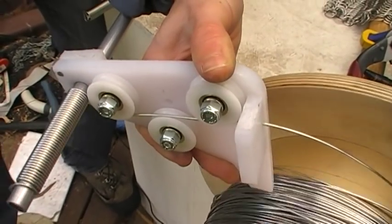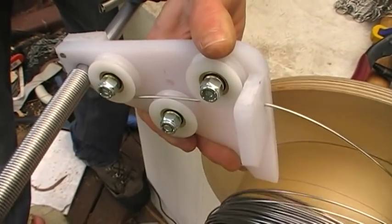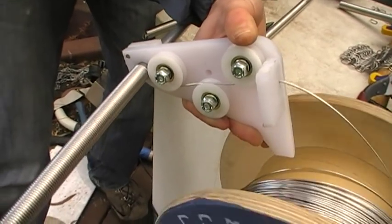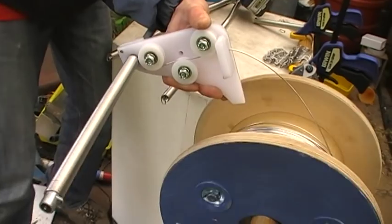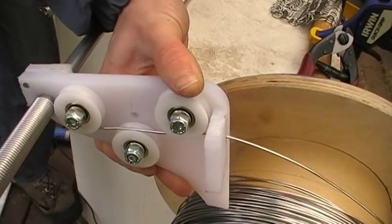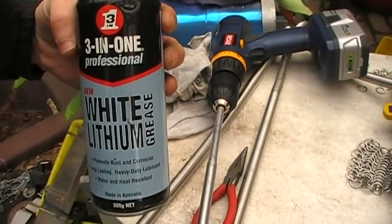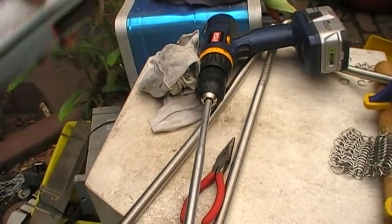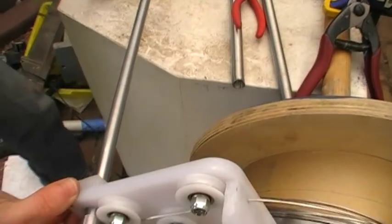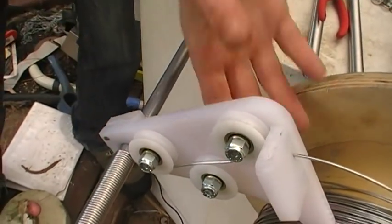The winding of it going through the jig pretty much pushes the bar through itself. The best part is all I'm doing is holding both the drill and the jig — everything else is feeding through itself. I've made this out of nylon so it won't have much resistance against the bar. I've also used lithium grease, just a really light spray, just enough to give it a subtle coating so that there's not as much resistance between the jig and the bar.